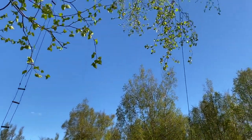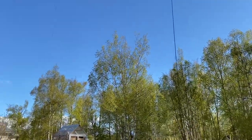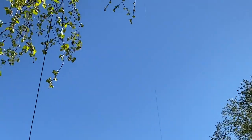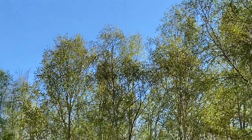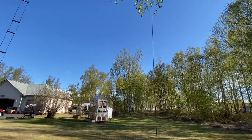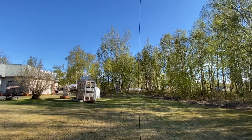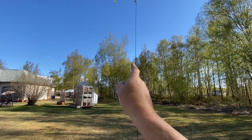So the V-beam — nice and simple, but 180 feet per leg. I wonder if you can actually see it. Oh there it is — it goes down to the top of that tree. And the other leg goes through the top of those trees over there, about 60 feet up I suppose. And it's okay. I'm using it on 10 megs at the moment, and the only place that it's actually any good — or better than my dipole — is down to Australia, which is basically the intersect angle north-east and south-west.